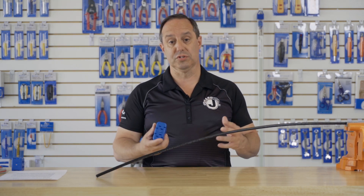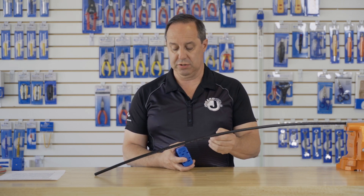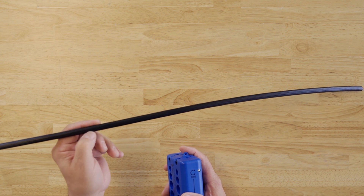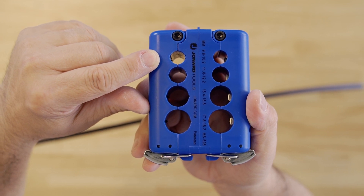To use the tool, first select the proper groove. With the Corning Altos cable, there are two ridges on here. You want to orient the blade such that it's in the center of the ridge. The tool actually has a mark on the side showing that ridge.